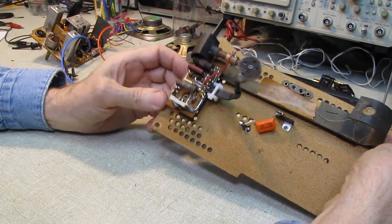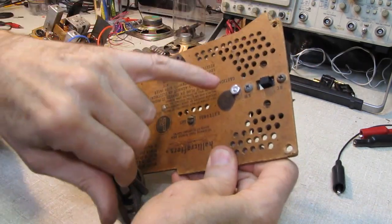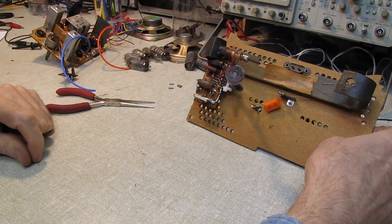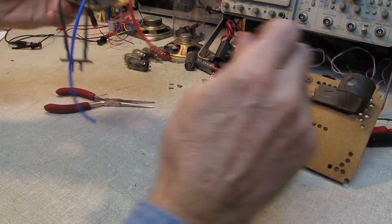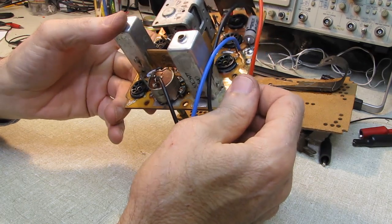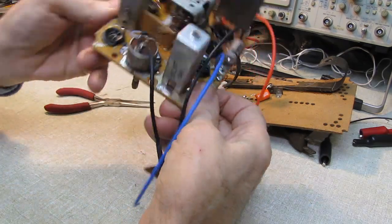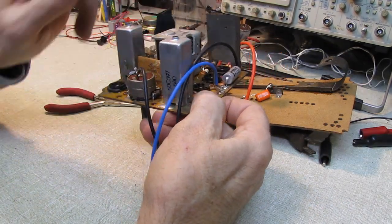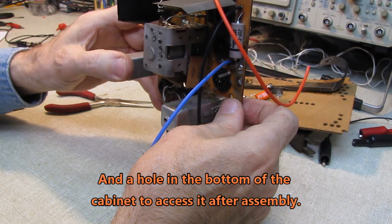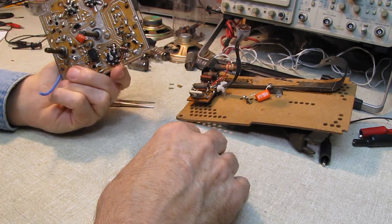And it's amazing. You've got 1, 2, 3, and 4 adjustments here to line up the antenna tuning for this thing. And I guess I'm going to have to take my best guess at the oscillator setting. The antenna section on here has a trimmer, but the oscillator section doesn't. Maybe there's just no way to tweak it in. I don't know. I'll take a look at the alignment instructions after we get this thing powered up.